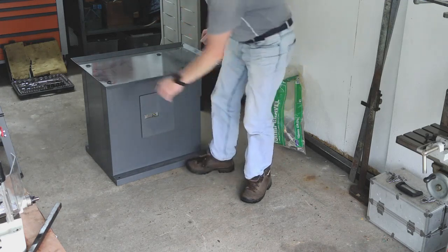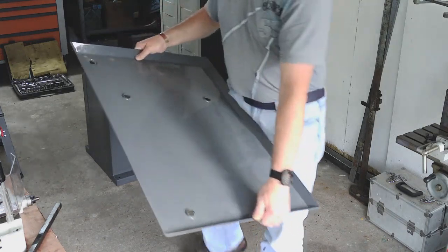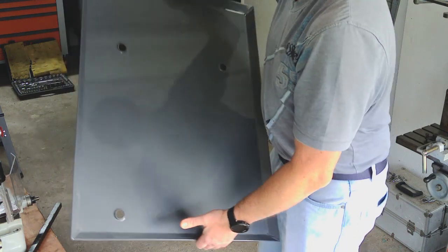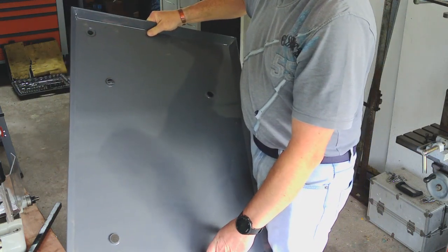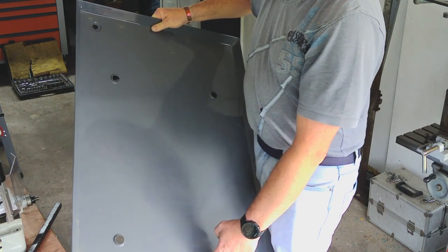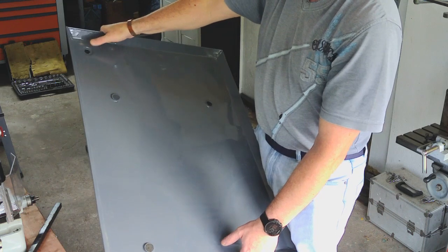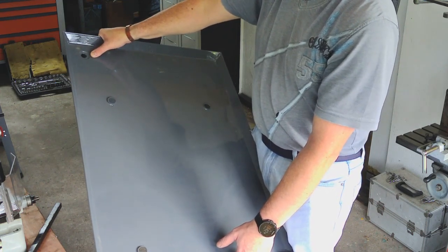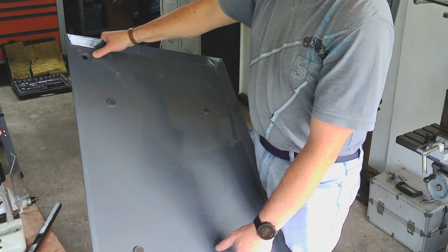Something that is a bit of a concern, and I won't know until I get my lifting gear, is this tray that the mill sits on. I can see all of that in shot there pretty much. So you've got the four main holes for the studding to come through. And there's one hole at the back that's recessed in the opposite direction, and I would imagine that's for a coolant drain or something to go back to a coolant tank, which is useful should I decide I'm going to put coolant on.